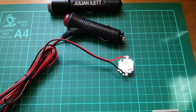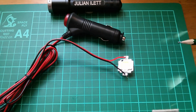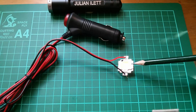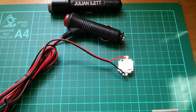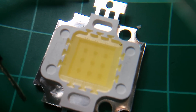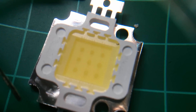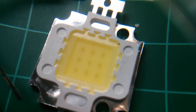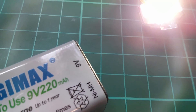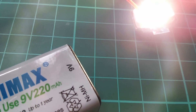What's to stop us connecting the LED directly to 12 volts? Well, the LED will instantly destroy itself. The incredibly fine wires — just about visible at the top of the LED, spot welded onto the metal — will act like a fuse, melt, and disconnect the LED permanently. That said, it is quite happy being connected to a 9 volt battery — so why does that work but 12 volts would fry it? There's only 3 volts difference.